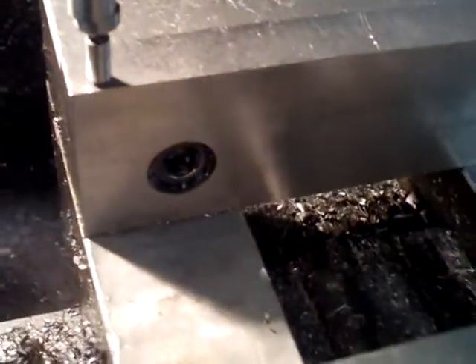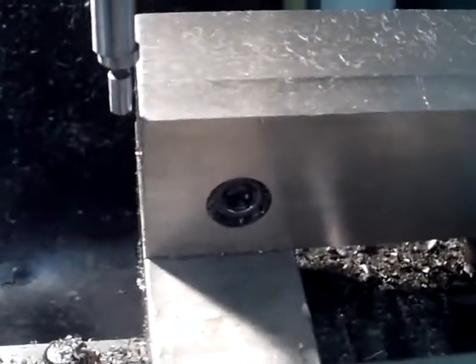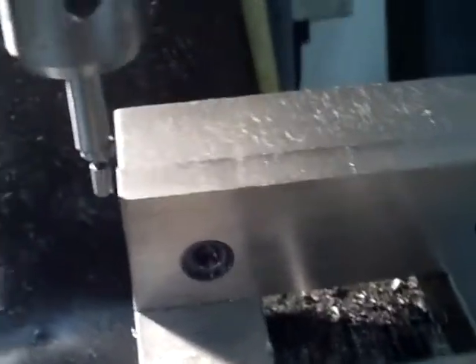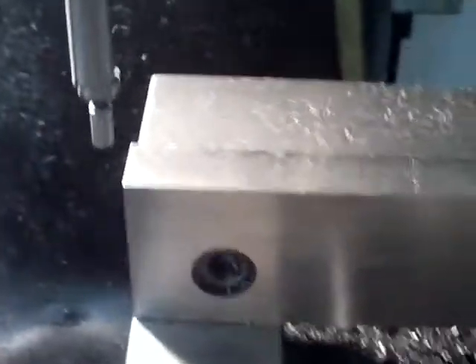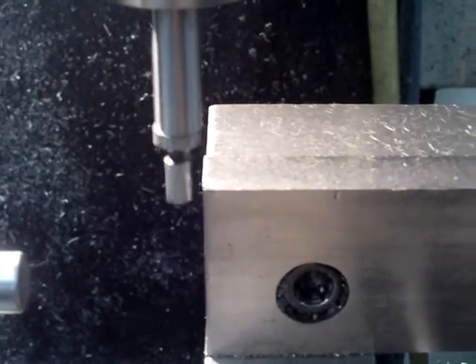So I'm going to move the x-axis — bring it beyond the edge. There's a gap there. I'm going to bring the spindle down. Try to do this with one hand; it's kind of difficult. We're looking at it from the side. You can see that we're below the top surface. So now what we can do is move the x-axis of the table up against that wiggler while it's spinning, so we can find the zero point of the x-axis. This one's going to have to be looked at from the other side, because this side won't show us.